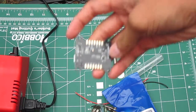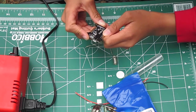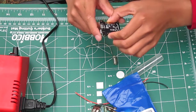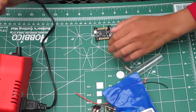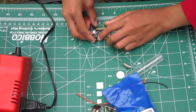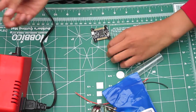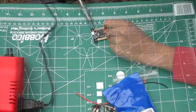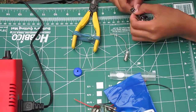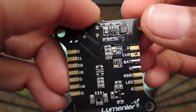I bridged the SRX — the middle pad to the SRX — as well as the middle pad to the five volt pad. Now that's done. We need to put solder on motor outputs one, two, three, and four, as well as the grounds, and the RX five volt and ground. I'll see you guys once I'm done doing that.